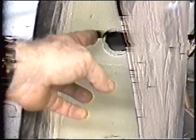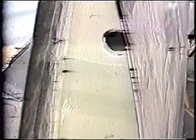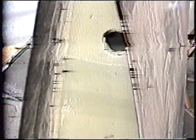Now, having removed the exterior skin first and then the back skin, I've established my bevel. Trying to make this as easy as we can. In a moment I'll remove this ring and we'll do the inside. I can clearly see that the bulkhead in the back side of the outboard member is well away from this area, giving me plenty of room for my torque tube.